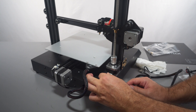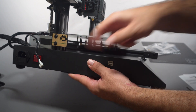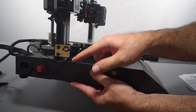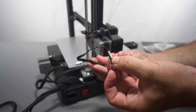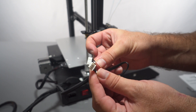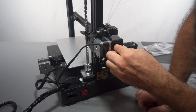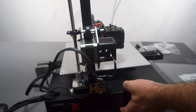Now we have the Z-axis — there's a Z on there, so we'll plug in the motor and the Z-axis end stop switch. The switch is around the motor on one side and the plug is on the other side, which is a little hard to get to. For the X-axis, find the wire labeled X with an M for motor. The motor plugs underneath and the X-axis switch is inside a little cover — also a bit hard to get to but not impossible.